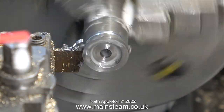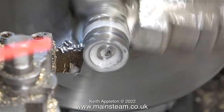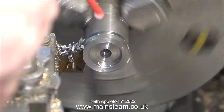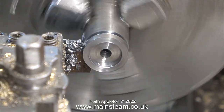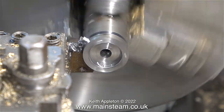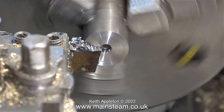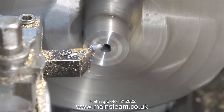In industry, with the proper tooling and equipment, it's probably a lot quicker than this, but in my home workshop I have to run the lathe in back gear to slow it down so I don't snap the tool. Now the video footage is running eight times faster than normal — you can see what's happening. I'm using a lot of WD40 to keep the part lubricated, and in the end it parts off all right. That's one done, one to go.